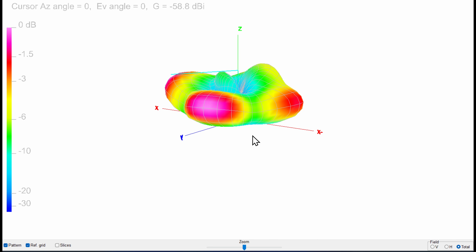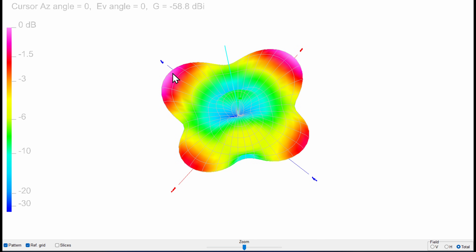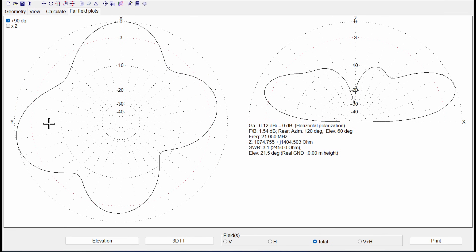After looking at the radiation patterns, I've decided to deploy the inverted L with the wire facing north. Here's a quick recap of the computer modeling on 15 meters with the inverted L. The antenna is this blue wire here, and off the corners of the end of the wire we have two nice lobes — about 45 degrees, two front lobes, two back lobes in a cloverleaf pattern. After uploading my last video, I realized that instead of running the inverted L on the y-axis, if I shift it over about 40 degrees, I can get the max gain on the elevation plot — max gain at 20 degrees at 6.1 dB, and at 5 degrees we're at negative 1.4 dB, and at 10 degrees, 3.3 dB. We also get a little bit of gain off the back corners, approximately 4.7 dB at 21.5 degrees.